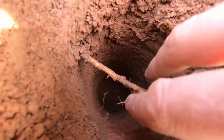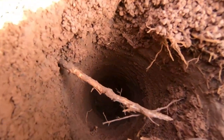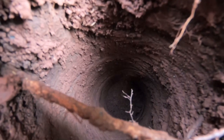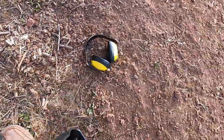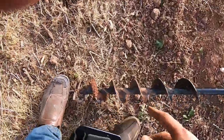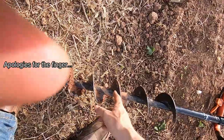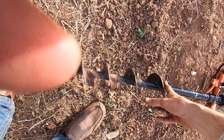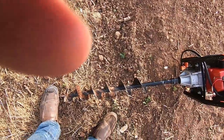Small roots like this one, they just rip through. In fact, they'll rip through much bigger roots than that. And the hole that it produces is a lovely straight-sided smooth vertical hole. It will go as deep as you like — the auger length is probably about two foot, 60 centimetres or so. And that's plenty enough for most fence posts.